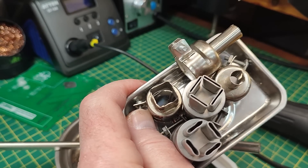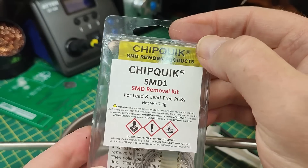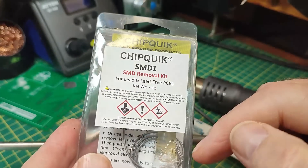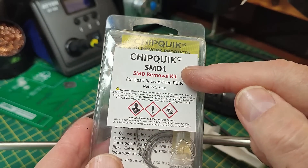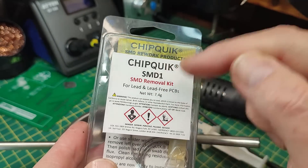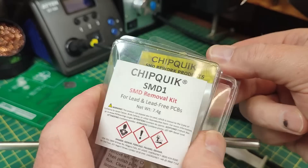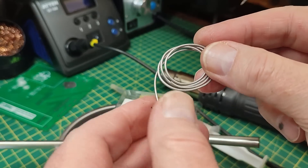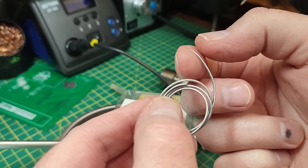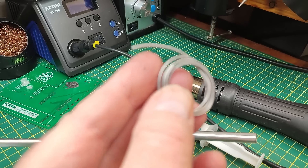It's not cheap, but when you have to, you have to. This is the stuff — you can find it just about anywhere for around 16 to 20 pounds for a small coil. It's sometimes called desoldering alloy, not the brand name, but probably the same thing. It comes rolled up, which is unfortunate because it's very brittle and will snap if you try to unroll it cold.